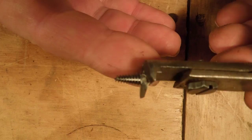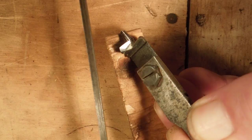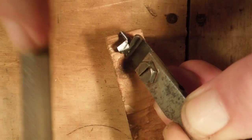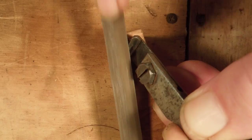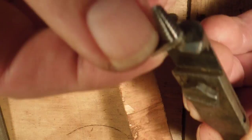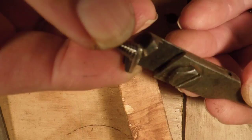This cutter has been sharpened many, many times. To touch up the edge of the cutter, we're going to use our favorite safe file, and carefully just smooth the edge enough to get a nice sharp line on it. We don't want to take away a lot of steel — there's not a lot there to work with. Nice and sharp. No shiny line along the edge of the cutter to give us the indication that it's dull.